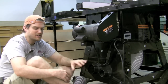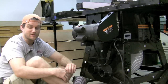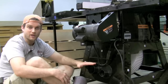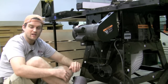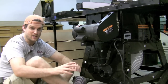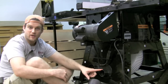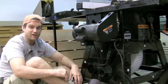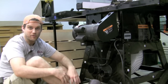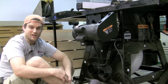Is it a necessary accessory? Definitely not. But I think it's very useful. I did run a test with the 2.5 inch port compared to the 4 inch — I've been using the 4 inch connected directly to the shroud with my dust collector for a couple of weeks, and running the shop vac on the 2.5 collected pretty much the same amount of material. I was really impressed with that performance. So there it is — the dust collection panel at the back of the SawStop Contractor Saw.